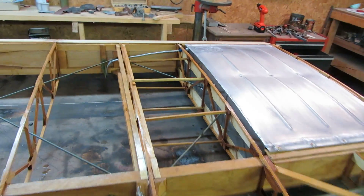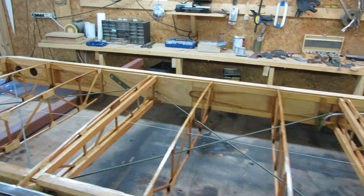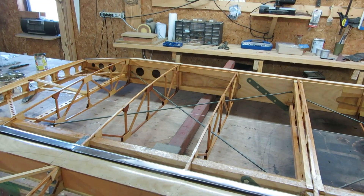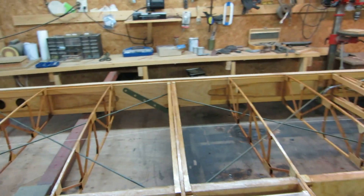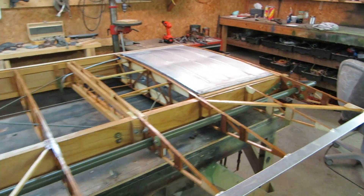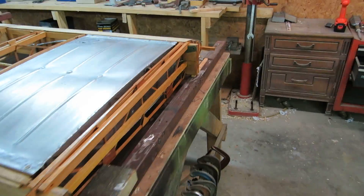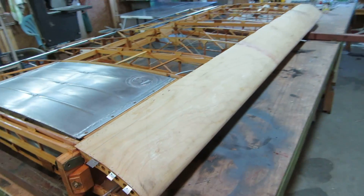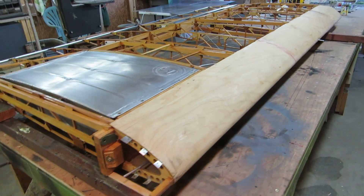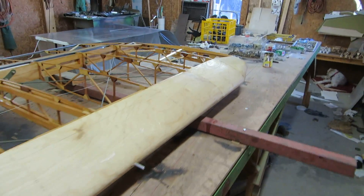The spars are built up — actually double eagle spars, shortened from 12 feet to nine feet. Got a one-eighth-inch web and quarter-inch spruce built-up ribs. This thing is a prototype and it shows in a lot of ways. I'm an amateur, not an engineer, and that shows up too in a number of ways. We'll start down here at the tip.